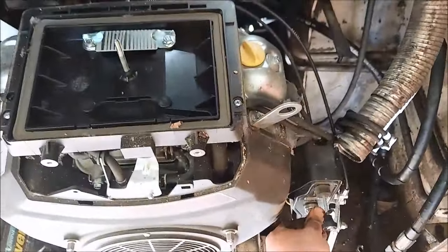All right, guys. So I got the new carburetor installed. You see that mark is just where I was banging on it. I was thinking the float was seized, which probably was. The old carburetor put back in the box. The box came with one spark plug, which is okay. And a new fuel filter. I like these style better because I can actually see the fuel. So I'm going to install that, rotate the engine back and hook up the exhaust, hook up the yoke, do the four bolts in place, and then we can maybe test it.